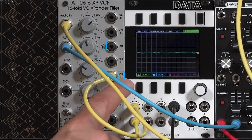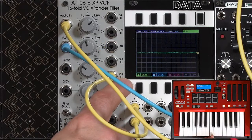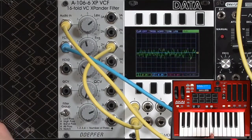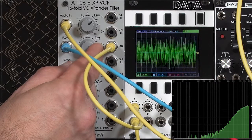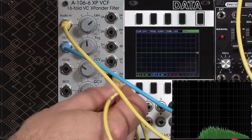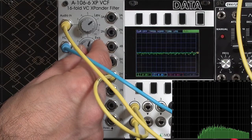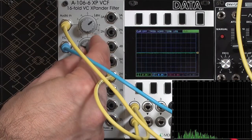There are actually two 2H1L filters. They have quite different sounds because they use different wiring with electronics. Here's the one on the right side, and here's the one on the left side. Much higher output level on the one on the left side, but it will not go into oscillation — here's the most resonance you can get out of it. Compared to this other version, which can get close to oscillation. As I sweep the filter, lower output but more of a peaky sound.